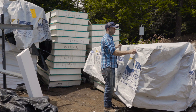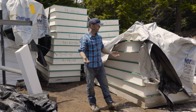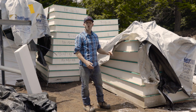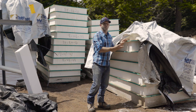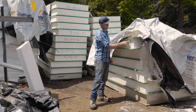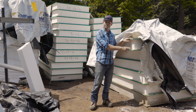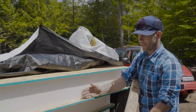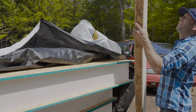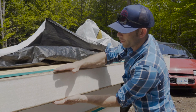These are our wall panels. All of the exterior walls are made of EPS foam sandwiched between two layers of OSB. They have no thermal bridging — even a 2x4 allows heat to transfer, but this foam does not. This wall panel is still fairly thin but it's rated at R49, almost to the point of redundancy. Air tightness is easily achieved by using spray foam to seal each panel to the next, then acoustic sealing each joint and taping it. Each panel has a recess and will sit on the board fastened to the anchor bolts. For panel-to-panel fastening, we use these keys that fit in with a little spray foam before pushing them in to create the joint.